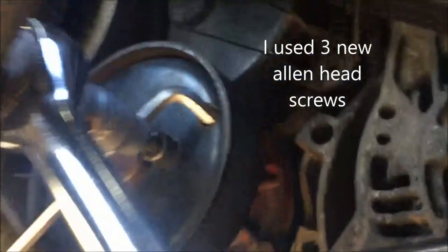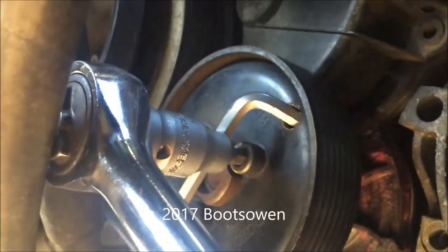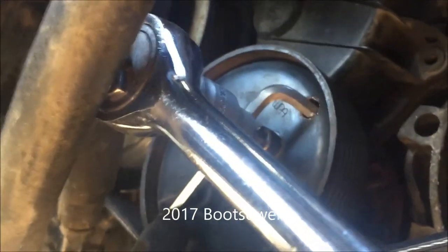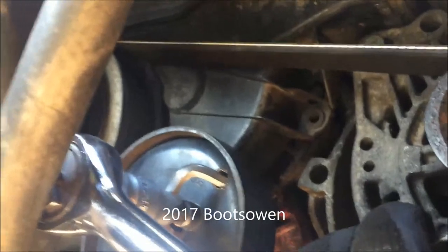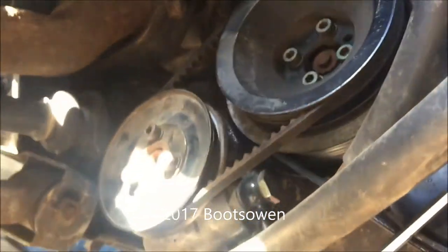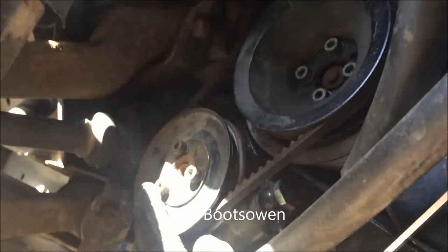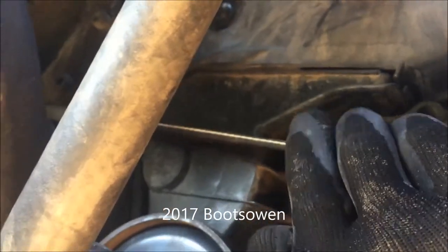When tightening up these little allen bolts, to get a grip — otherwise the pulley just spins — I put one allen key into this little hole on the edge and then tighten against that, using it as a lever. That's about it really — tighten that one up and then put that little belt back on and tighten up that one in the same way. You can either put the allen key through the hole in the centre, or lever from one allen key to another to tighten it up. There's the tension on that belt.